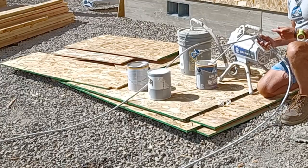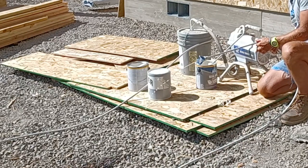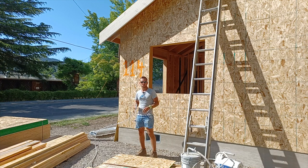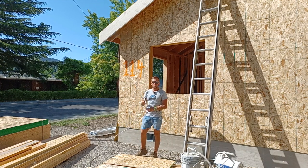The first 45 seconds will be water that I use to clean out the line. Now that the gun is primed and we have paint all the way to the end of the line, there's still going to be a little bit of water. The first couple minutes of spraying is going to be a little diluted, so go back over that spot where you start.